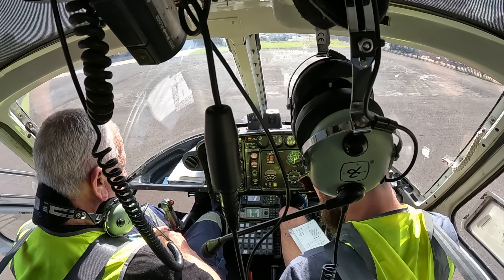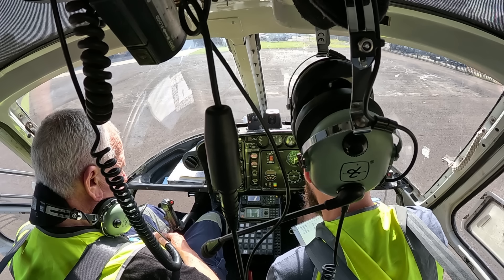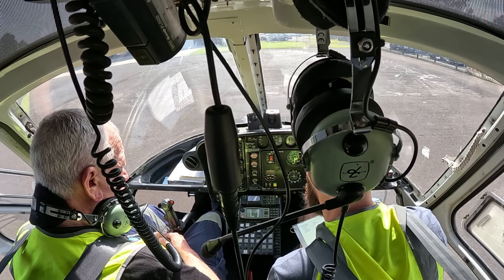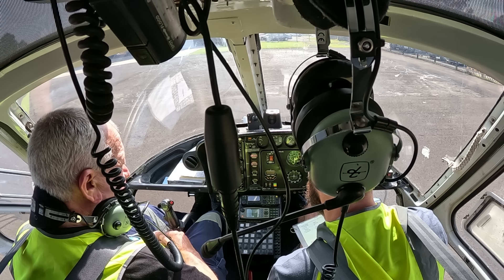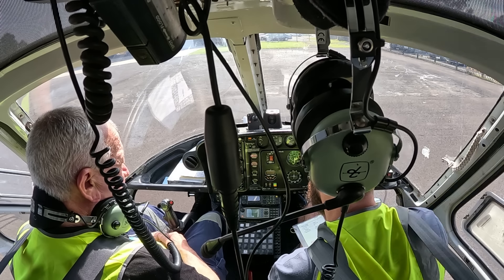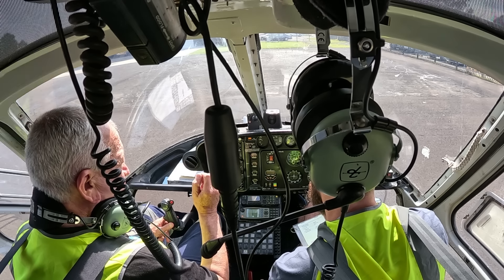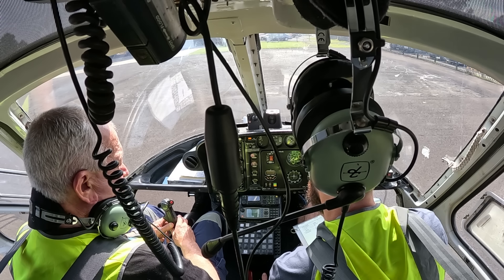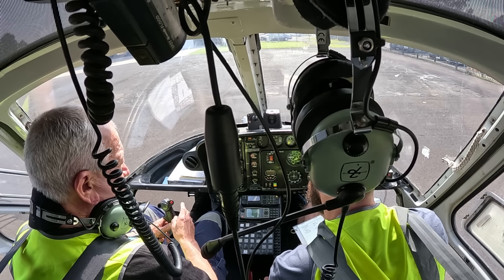Okay, so there's 30 seconds. All yours. Just a little bit there. Blades clear — all clear. Okay, advance. A bit quicker. Looking for a light — there we are. Okay, keep feeding it to 12. Blades are turning at 25 — keep feeding it. 42 — finger off the start. Keep the feather at it. 70, 100%. 90.